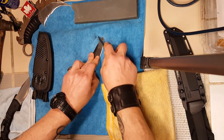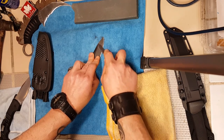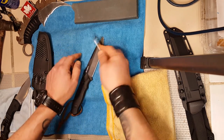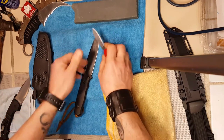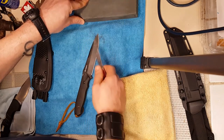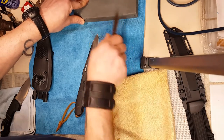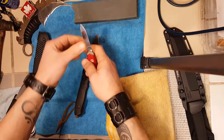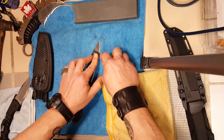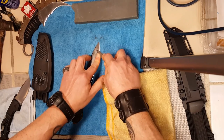The 154CM on the Nimravus seems to be darker. Once you get in underneath the initial top layer, just go back and keep going — don't change the angle, don't rock your knife, because you can mess up the metal underneath. You're not really going to gouge it because 154CM is way harder than this Swiss Army knife steel. That Swiss Army knife steel isn't hardened very hard because it's supposed to be a user blade, easy to sharpen in the field with a smooth rock.